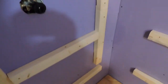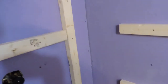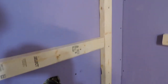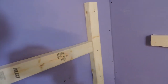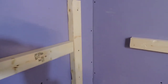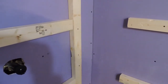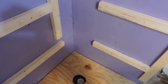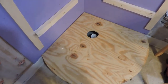I was not going to rip out all the plaster and lath and reframe the inside of the wall — that would have been insane. The only other way I could have stiffened this up is if instead of drywall as the backer I had put a piece of plywood — maybe half-inch or thicker — then I could have run screws into that. But you also have the issue of moisture with plywood. With this purple moisture-resistant drywall, I'm at least fighting against humidity and water splashes from the shower, so I still think this was the better way to go.